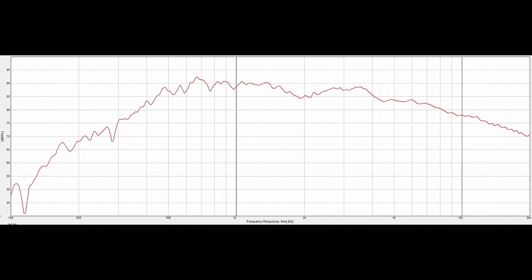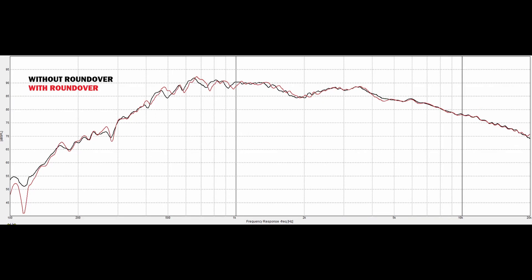So here's the after measurement. Here's an overlay — they're not looking much different to me. There are some changes, especially below 1,000 hertz more than anywhere, and this is because I probably didn't get the speaker in the exact same spot as before, so the reflections — especially in that wavelength of however far I had the speaker off the floor — moved a little bit. So ignore that. The main area of concern is above 1,500 hertz, and there's virtually no difference here. Maybe it did something, but not really.